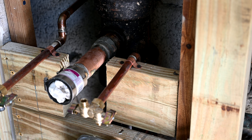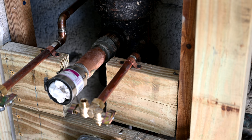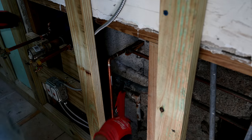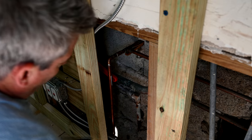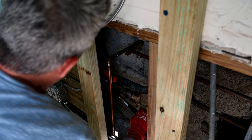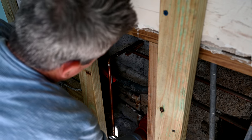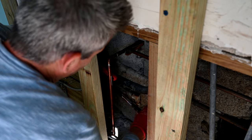They don't use these stacks anymore, but we find them a lot in old houses. This house was built in 1946 — back in the forties, that's how they did plumbing. It was all put together with lead, and I'm even surprised this part was threaded because a lot of times back in the day they were just put in by melting the lead. So you can see with your wrench on there, we have very limited range here. Once it's on there tight and not moving, make sure you're holding it snug and just start giving it a whole bunch of little light taps.